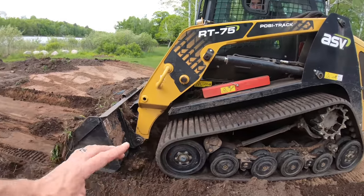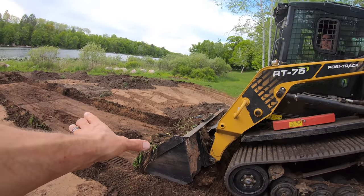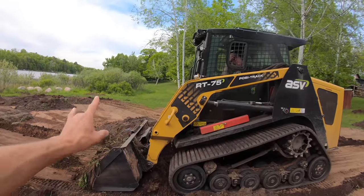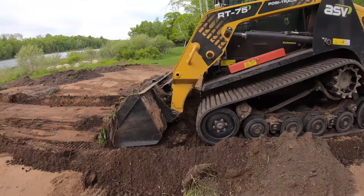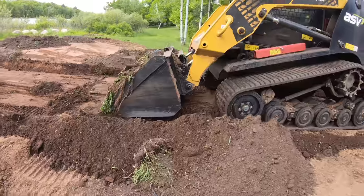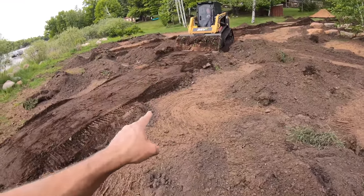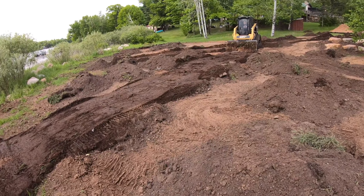As you're going up a hill where you were level before and your bucket was leaving material, now the angle of your machine has changed and your bucket is being more aggressive. So as you go up the hill, you've got to put the front lip down — you've got to adjust that yourself. Even though the bucket is in float mode, it won't do that for you. Wherever you're too high, when you're going forward you would grab this and start pushing material into different areas — that's where those forward grading skills come in real handy.